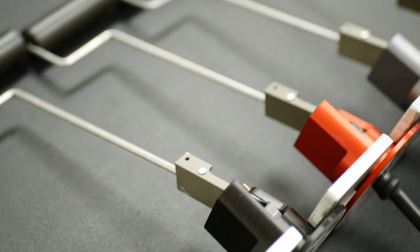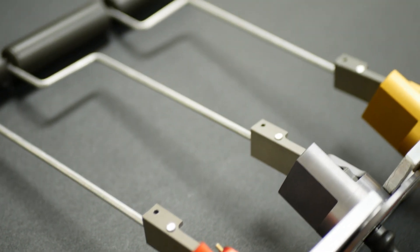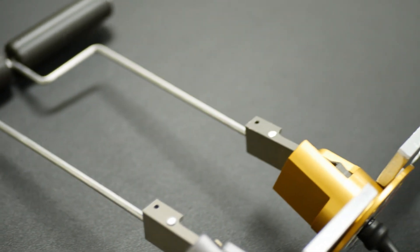This video will be applicable to certified installations as well as experimental. These beautifully machined aluminum fuel senders have a lot of upgraded technology packed into the same form factor as the old units you are replacing. There will be a few notable differences — don't let this scare you. As long as you follow the instructions you will have a great installation and the aircraft will actually have fuel level accuracy.